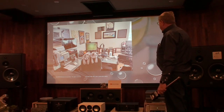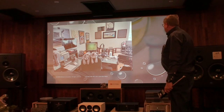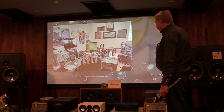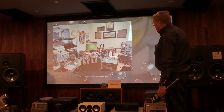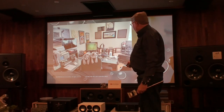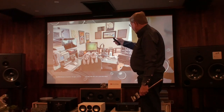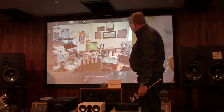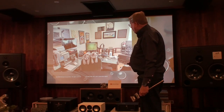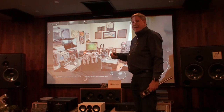This is the lab we use at our office. This is the Keyence VHX-7000 microscope. Here I'm looking at an Edison cylinder. We use the Ortofon TC-3000 tester — we put a test record in the machine, print out the dB gain and signal-to-noise ratio, then restore that record in our system, replay it, and see the dB gain on the printer. This proves the gain.